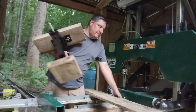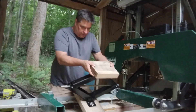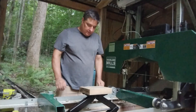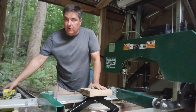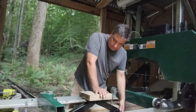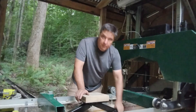So this board is about as good as I need it. Now we're going to turn it this way — the end of the log will be down here and I have better access to this driver nut. There you go — that sits in there like that. Now this came with a pretty long crank handle and I don't intend to use that. I'm either going to put some kind of socket driver on here or I might use an old drill with a nut driver in the end that fits this — what looks like three quarter inch bolt head here. This thing will do pretty good, I think. I'll be able to move it a little bit depending on where the log is, and I've got a couple other spots I can use it on the mill.